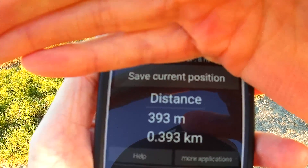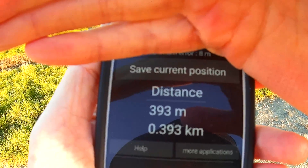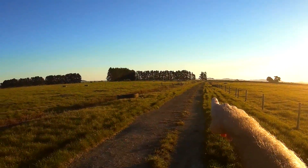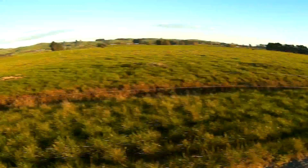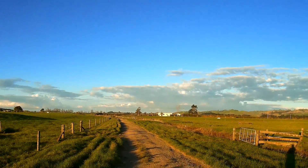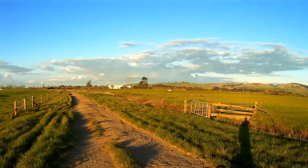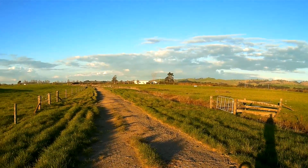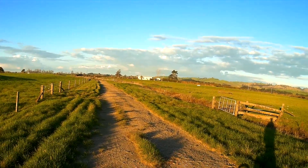So as expected, the IA6B does a little bit better than the X6B. What I might do now is drive the car back to the starting place, then take my video goggles back up to the 500-meter mark and see if the video gets any worse at that point, and how much difference the helical antenna will make.